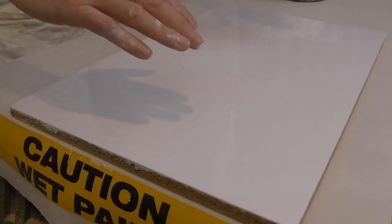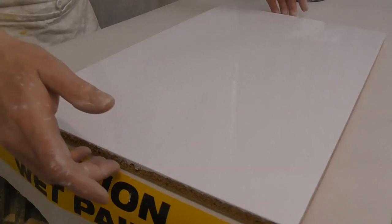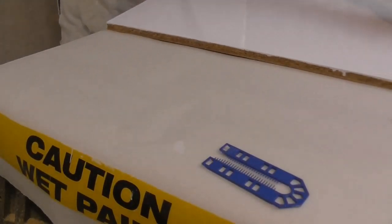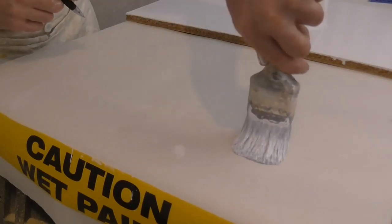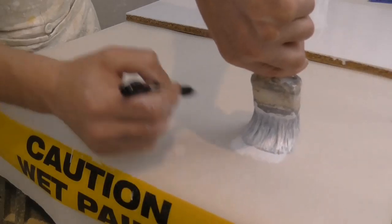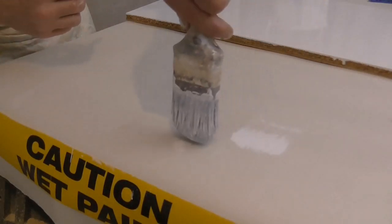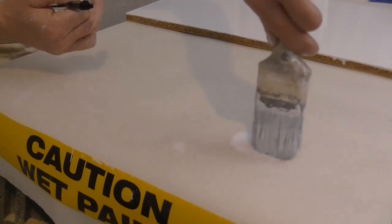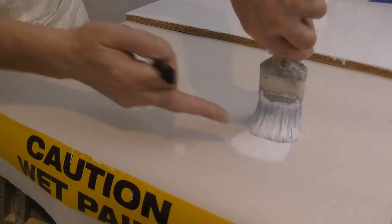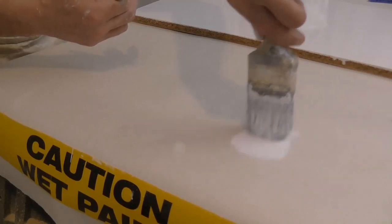Now, as that dries, the brush marks will slightly pull together and it'll look even smoother. Now, I'll explain the principle behind laying off. I'll just put that board there for a second. So your brush with the bristles, the harder you push it down, the wider the splay. So if you only put a little bit of pressure on, the closer they stay together. Right? So the harder you press, the wider the lines. Lightly, and they're not as wide.